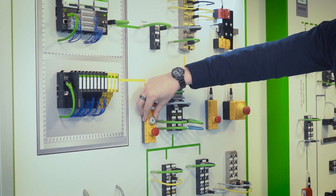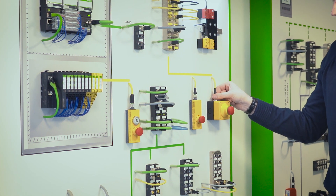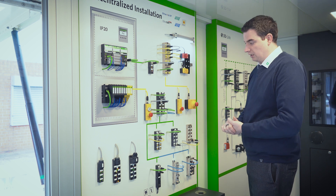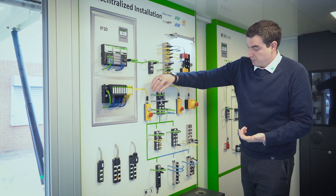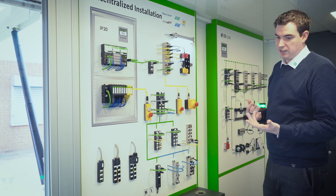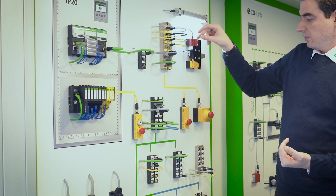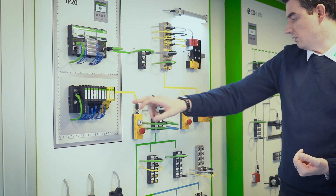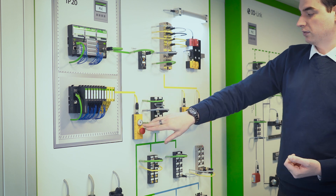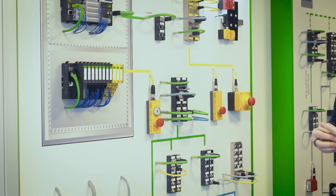We also have a range of E-stops with reset buttons or lamps, E-stops without, or a more classically sized E-stop with an M12 interface to control the contacts and trigger inputs and outputs, push buttons, etc. — all of which are dual channel. These models are particularly nice at 40mm width because they fit perfectly onto aluminium extrusion and even come with a pack of T-slots and T-nuts. From the safety point of view, pressing one E-stop drops out its corresponding unit and cuts power, as needed within the program.